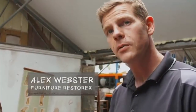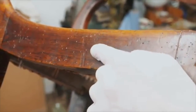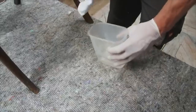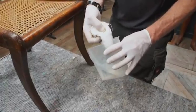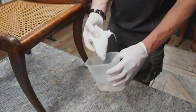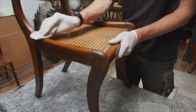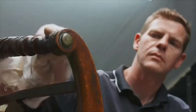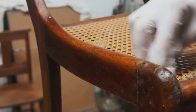The chair has a few issues, the biggest one being the woodworm, which is still alive, so the first thing we need to do is kill it. There are various ways to treat woodworm — we're going to use the liquid form. We apply it with a rag and make sure we rub it into all the holes and cover the entire surface of the chair. We want to make sure we finish them off so they don't come back later on. Now we've covered the whole chair, we'll let that dry.